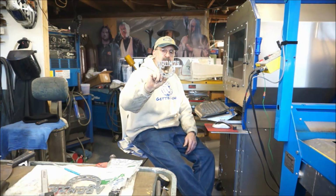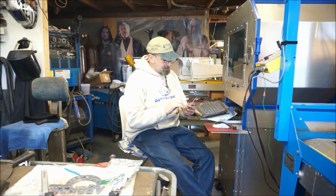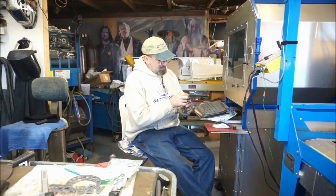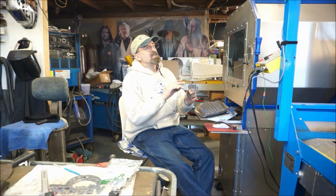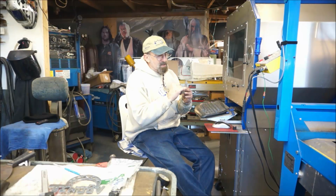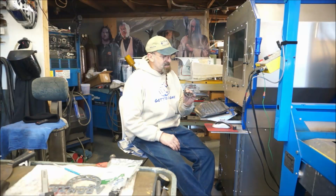And so what we're doing is I've cut out, this is the third one I've cut out, just making some adjustments. And the last one I wasn't able to cut out the center of the A here. So I went ahead and I adjusted that. Time before that, I wasn't happy with my pierce point. It was piercing and put a little dimple in on the end of the thimble on the micrometer, and it's supposed to be nice and round. So I changed that location.